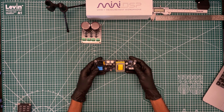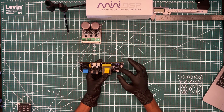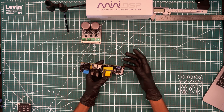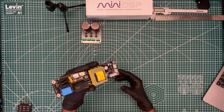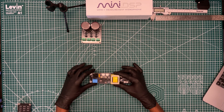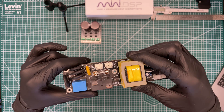This is a standby board. What a standby board does — it is built on a completely different platform, controlled by integrated circuits. You have ICs here which control the entire function. This is not based on a relay where you just supply it and it triggers in and out. This is very heavy and has its own transformer — just check the size. It comes with a fuse for protection. It has AC in and AC out.